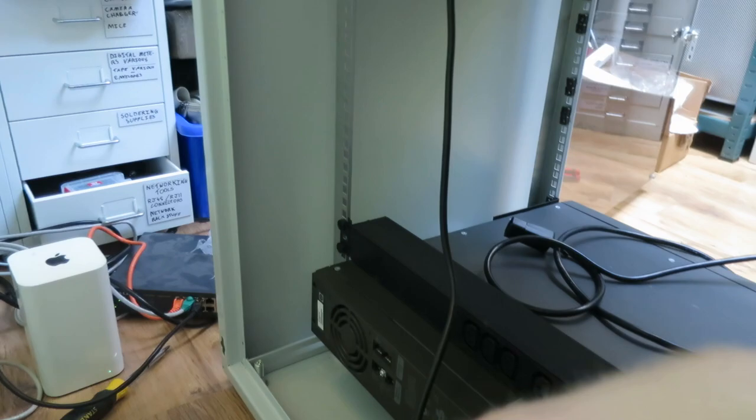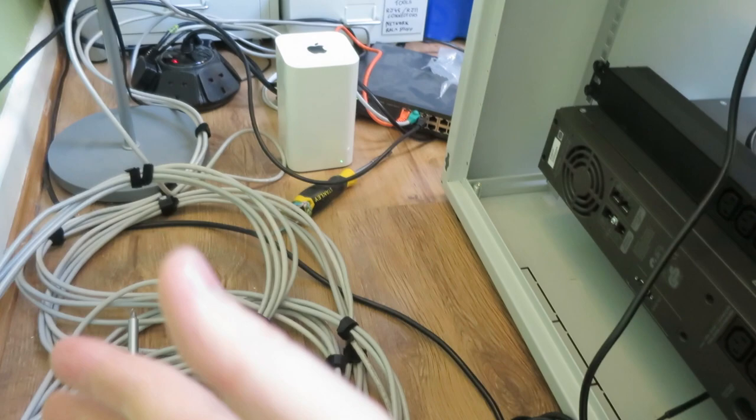And that'll make it a lot easier to open the door, because there's a very short earth cable attaching the door here. So while there are no cables running through it, you can just angle the door outwards and lean it against the side of the rack. If I have network cables going through the door and I cable manage them all neatly in the rack and then put them into the patch panel, it's going to be a royal pain to get the back door off with enough clearance. I'd have to unbolt the earth cable and then just feed the door backwards with the cable still going through it. So, long story short, we are going to try not to use any of these holes eventually. So by the end of this video, you should see all of this completely free and hopefully with brushes on,